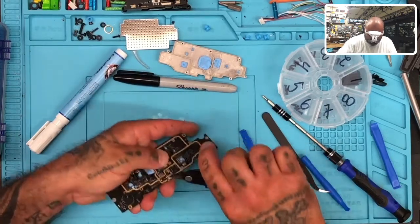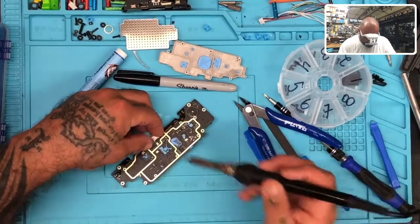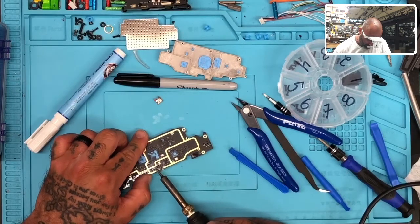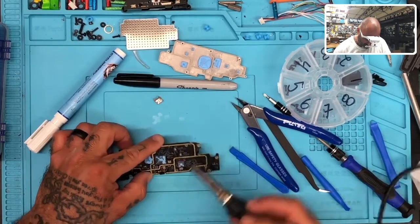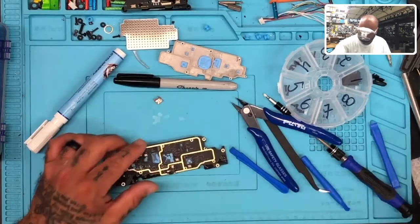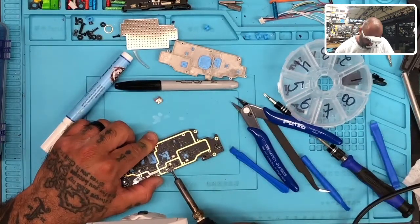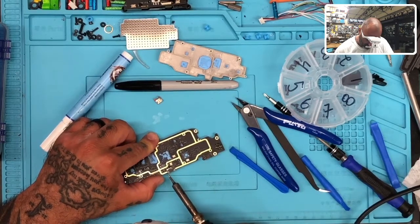If I separate them from the USB port and then just heat them up later to get them off, it'll be just fine. Now that I can wiggle it, I'll start heating up the pins one by one and pull it off. The pads are preserved. I will now go back over them and clean up the solder. I can see the five pads where we're going to do the soldering. I'm going to go over the pads real quickly — one, two, three, four, and five — and clean up where the bracket was knotted.